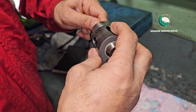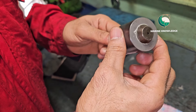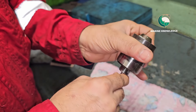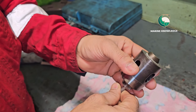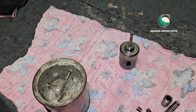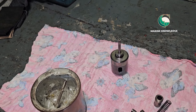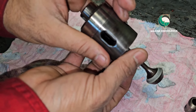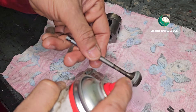After doing the lapping, inspect the mating surface again. If the scoring mark is removed, you can do the leak test and proceed to boxing up. If you couldn't remove the pitting mark or scoring mark — in case it is very deep — then it is time to discard the spare and use a new one. I have done the lapping; now I will clean the area and inspect both seat and spindle to finalize whether I can use them or not.